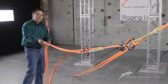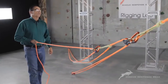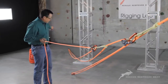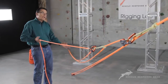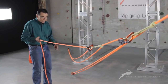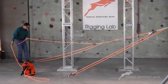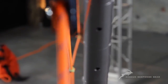We have a 3 pulling on a 3, so now I'm going to have to pull 9 feet of rope on this haul to lift that load one foot. That's the trade-off — nothing in life is for free. By staggering the back anchor, because this back 3-to-1 is going three times faster, this is a little more efficient. It's going to allow us to have fewer resets because the rope is being gobbled up so fast. I have a little more of a walkway for it too. Nine times easier, but I still have to pull 9 feet of rope to move that load one foot.